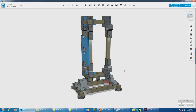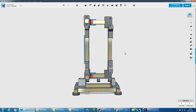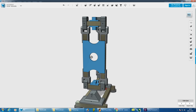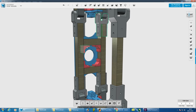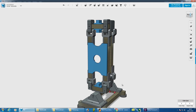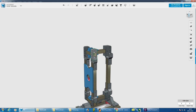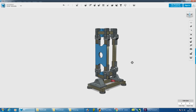So building up another stage here, we're going to put the lower leg on, and you'll see this familiar parallelogram looking thing that we had in the GONK Droid, albeit in a triangle shape from the top, so we can get the actuators down in the 2 gaps. And again, just aluminium extrusion built up, some HT printed brackets there. And again, I think I'm going to use the metal brackets to hold this piece really rigid, and I'll probably put an ABS plate on there in blue just so we've got some more blue parts really. Don't know if it'll do much for the rigidity, but it's going to set it off and make it look really nice. And of course we've got these brackets with double hooks on, so again the upper leg will go on the top there in exactly the same fashion.